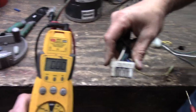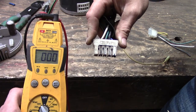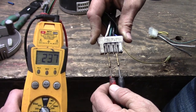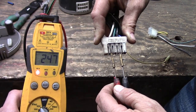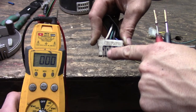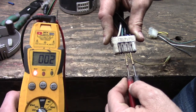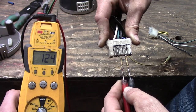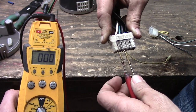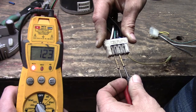This is a 220 motor, so first we're going to test to make sure we have 220 volts. To test for 220 volts, you're going to test between L and N. We're going to put our probe here and here and we're reading 246, which is fine. The G is a ground wire, so either L to ground or N to ground should test 120 volts. There's 120 between L to G, and testing between N to G we also get 120 volts.